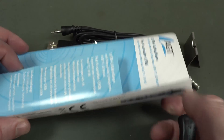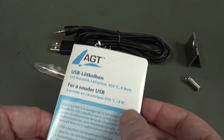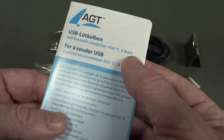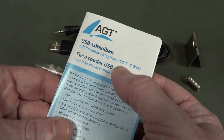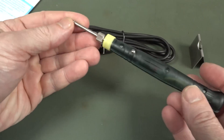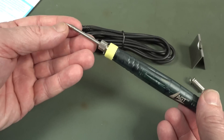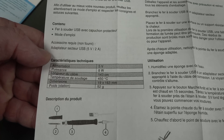This particular one is AGT branded — like German branded or something — but from the looks of it, the mold and everything else looks absolutely identical to the five dollar one you can get delivered on eBay. So I'm going to assume they're identical for these purposes. It's a nominal 8-watt soldering iron. Of course you couldn't get 8 watts from a normal USB outlet at 5 volts, 1 amp — you'll only get about 5 watts maximum before protection kicks in. Assuming you've got a higher current source, you can do that. 450 degrees C, fixed temperature. And there's the specs.